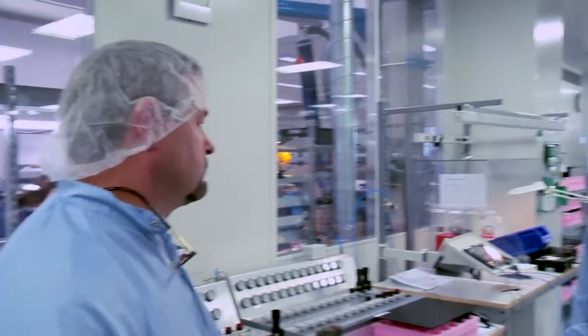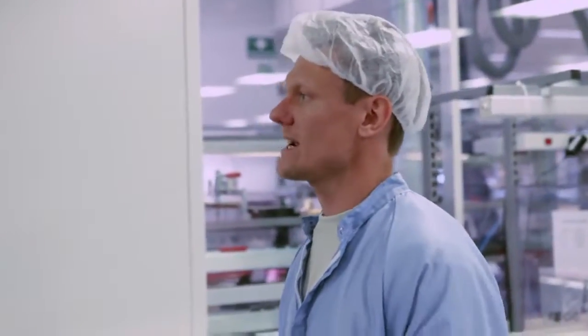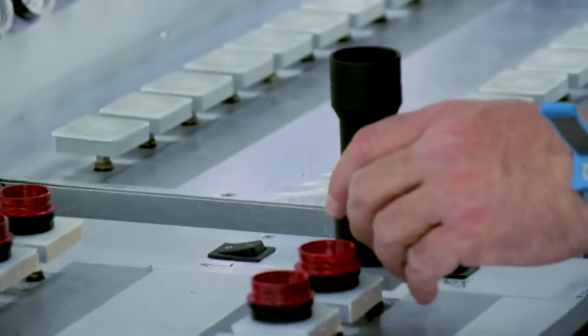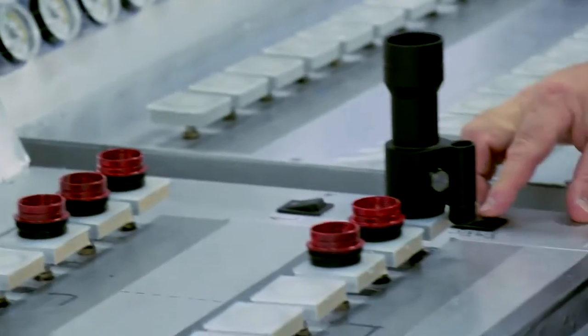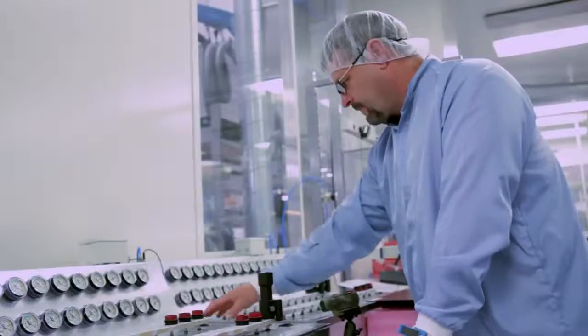And then a certain amount of sights are sent into our laboratory and tested in a water tank. And that is equal to 45 meters. 45 meters down. So they're going to be held down at 135 feet depth for 5 minutes or so to make sure that they're completely waterproof, which is way beyond what any of the optics should ever be required to do, but it's nice to know that they will retain the waterproof capability at that depth.